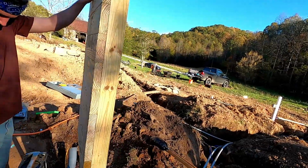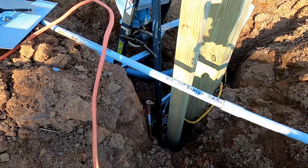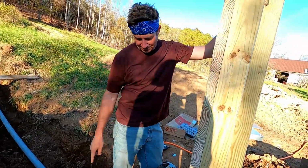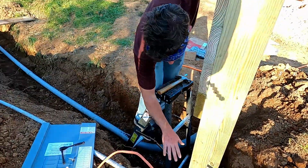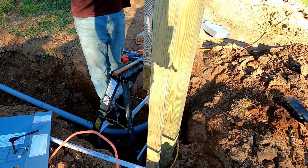And we have also installed our grounding rod. That copper rod is 8 feet long, into the ground. And it looks like it's above grade, but it's not because it's in a trench. That's just for visual. We're going to backfill all this stuff up to about here. So I'm actually going to put probably 2 more boards onto this, so it's a full wall.